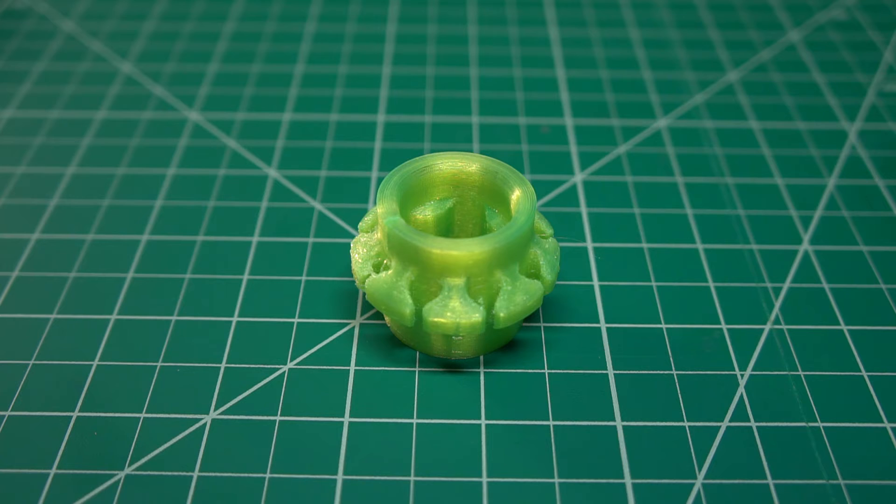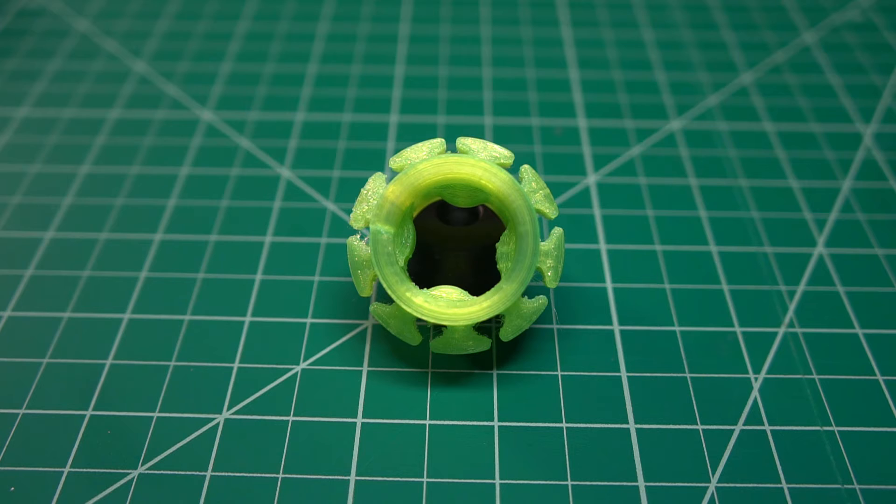In version 4, I redesigned the retaining ring to make this virus-looking thing. My hope was that it would reduce the number of retractions the printer had to make and in doing so make for a cleaner print, but it didn't really work out. I also think that a full ring would be stronger and make for a wheel that rolls more smoothly, instead of one that's kind of broken up like this.